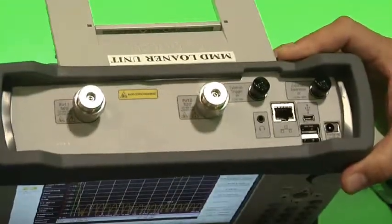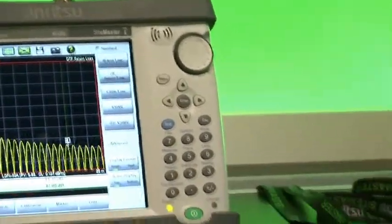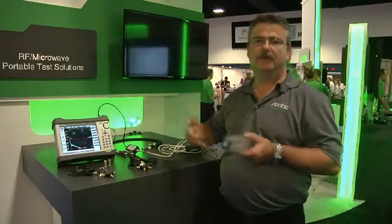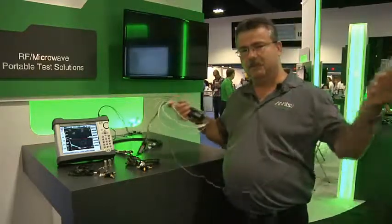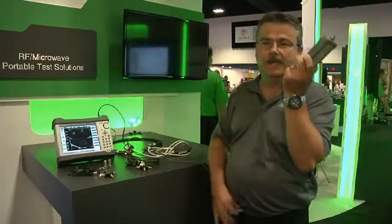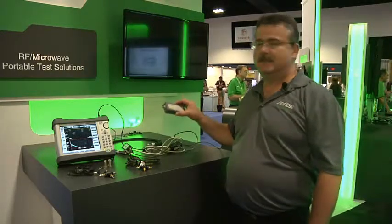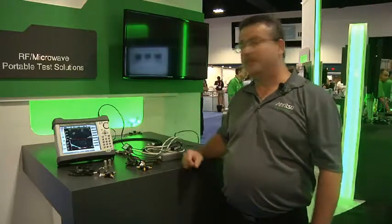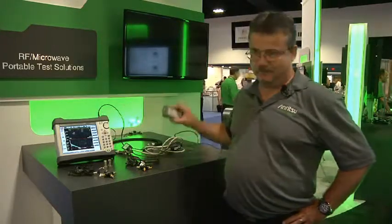Even though this is a field product, we put the same quality ports on that analyzer, and this allows us to do the heavy duty conversion into N-type. A unique feature of the Microwave SiteMaster is its ability to measure long cables embedded in aircraft wings or fuselage, or even waveguide. Using this sensor with USB extenders, we're actually able to extend out to almost 300 feet to reach the far end of a cable that is embedded inside a wing, fuselage, or bolted up an elevator shaft. This capability was previously only available in scalar analyzers, so not only is it a vector network analyzer, it also has scalar network analyzer functionality via these sensors and the extender kit.